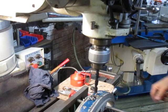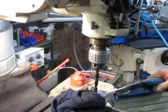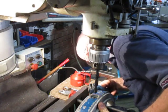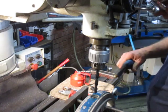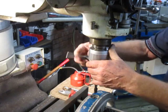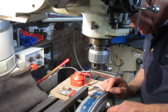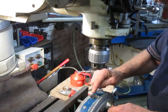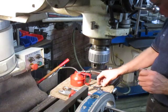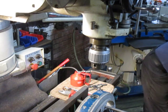We're all the way through — nothing's grabbed or anything like that. The oil hole should be daylighting out there. So what we'll do now is get a milling cutter and see if we can mill out. We're not 100% in the centre but I think we're in enough that if we can get rid of that top washer, we can then see the thread and work along with our milling cutters until we've got a good spot there to grab the centre.